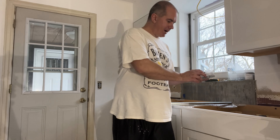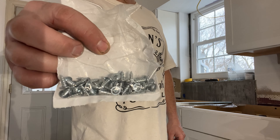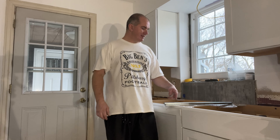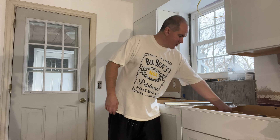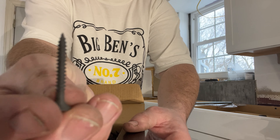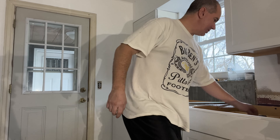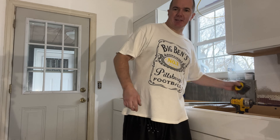You'll also need a pan head screw — I'll drop a link below for those, very cheap on Amazon. That's how you secure your slide into the side of the cabinet. You're also going to need inch-and-a-quarter drywall screws; I use fine thread because they hold better. And you'll need a drill with a phillips bit. That's all — no pre-drilling required.